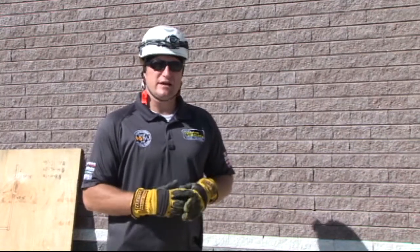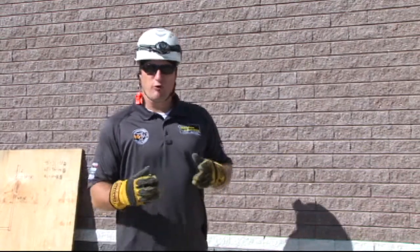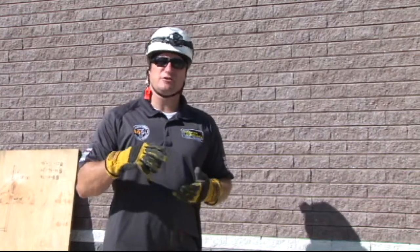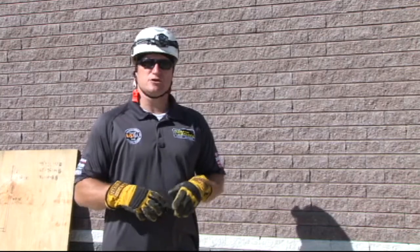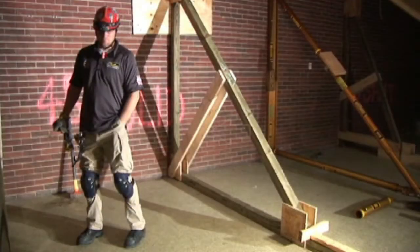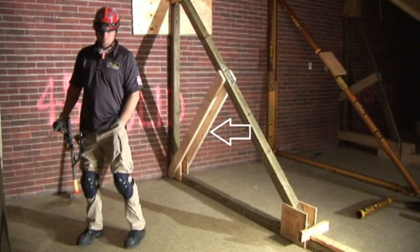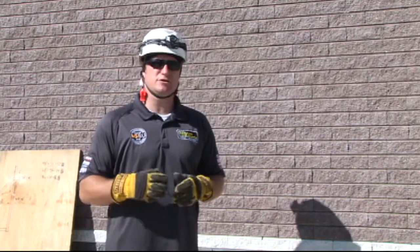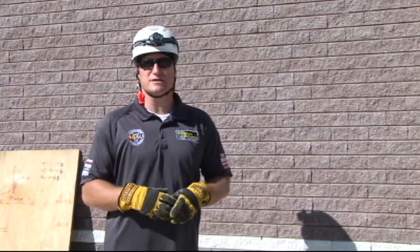Another thing that is a good indication for us, that we can be aware of before we even start fabricating, is some of the determining factors or the cutoffs with raker design. So if a raker itself is greater than 11 feet in length, we know that we're going to need midpoint bracing. With an 8-foot insertion point, you're going to be at 11 foot 3 inches, so we can already start pre-planning for that midpoint bracing and establishing that.